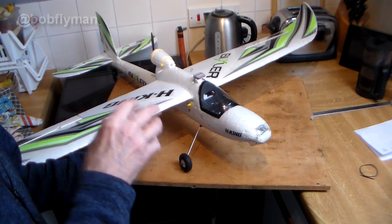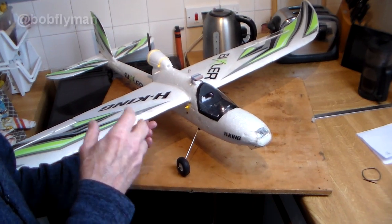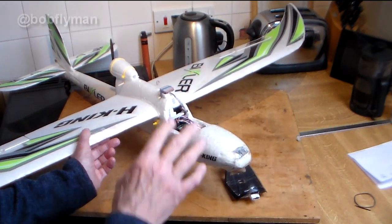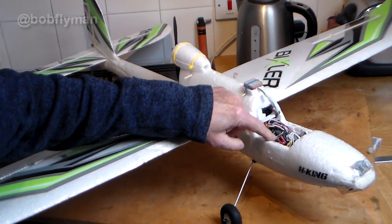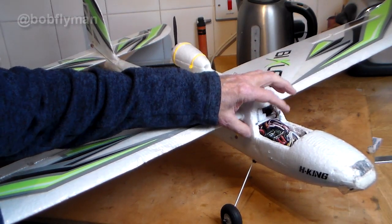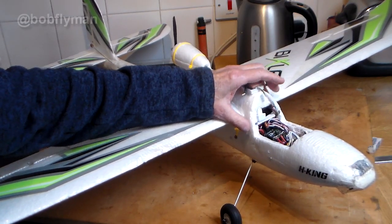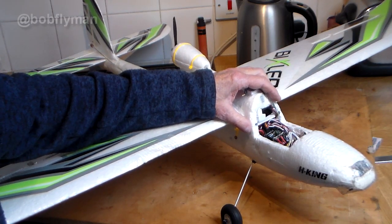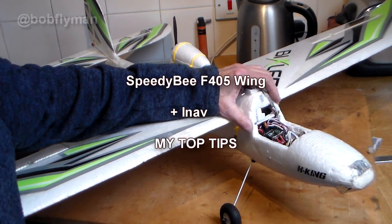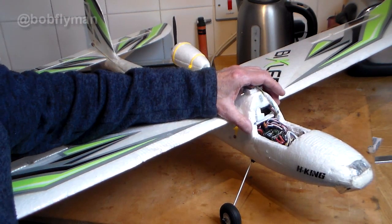In Part 2 here I explain just what is involved in getting my Speedy B firmware installed properly, getting the iNAV software configured properly, and then getting it all to work on this aircraft — which isn't totally suited to the job because you need a fair bit of room in here to get things installed. I don't intend to go into huge detail about the assembly or the millions of modes and configuration details in iNAV — that's been well and truly covered by other people, particularly Andrew Newton and Ian at Painless360. But what I do want to try and do is give a few tips about some of the essentials I found that might steer you the right way in trying to sort your own problems.